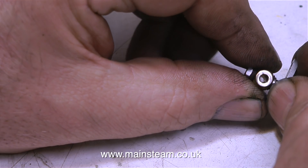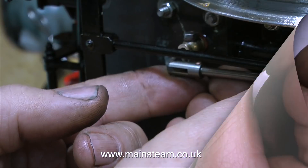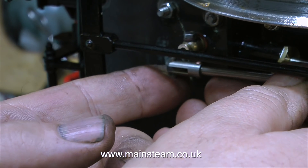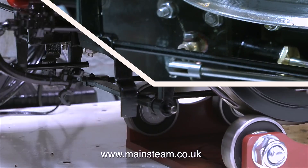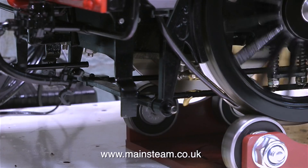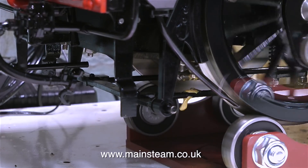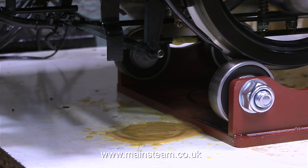The fix is simple. I unsilver-soldered the thin capillary pipe from the end of it, then cross-drilled the moving part 3/32nds of an inch, and re-drilled the body of the valve a bit bigger too. Then I put the valve back together including the two o-rings that make it watertight, and now when I push the rod in the cab, the drain cock opens — quite simple. It didn't do this before; it was completely ineffective. So if I can do it in my small home workshop in Dewsbury, I fail to see why it cannot be done at the factory in China.